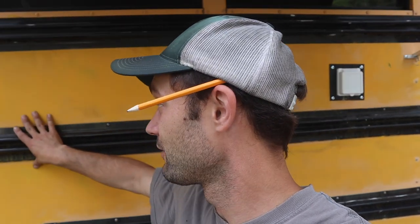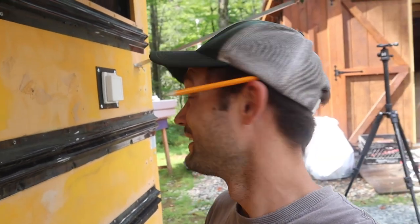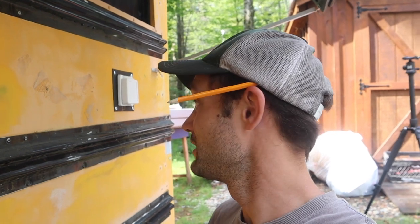The solar and batteries are all right here, so it's pretty much the easiest modification that I can make, because she doesn't want to move the panel from this location. So we got to somewhat work with what we got and just make it as good as possible and usable for her when she's living. Just because one of the biggest issues with her system is not that it didn't work. It's just that it only ran off the solar. So if there was no sun or she was parked in the shade, her batteries would just deplete, and she has no way to charge them. So this 30 amp is going to give her the ability to plug it into a charger, charge the batteries up, and then we rewired in an alternator connection so she can also get that done.